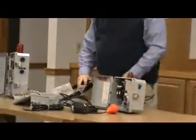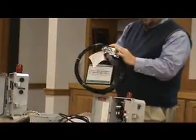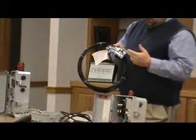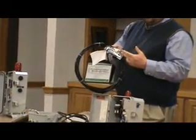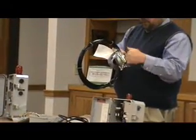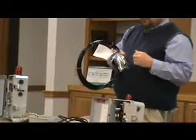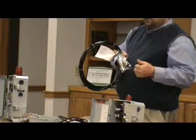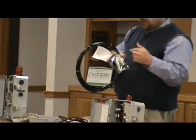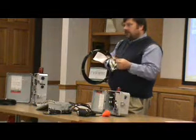A transducer is actually some type of a strain gauge relief that's built down into this little stainless steel head. Based on the pressure at the bottom of that wet well, you're going to see an increased pressure on this strain relief, which is going to send an electronic signal based on how much pressure there is into the control panel. When you have a device like this, you have to have some type of a special device that can read that signal. So float switches can go basically into any type of panel that takes a switch. This you'd have to have some type of a controller or a PLC to be able to read that signal that's coming out of it.